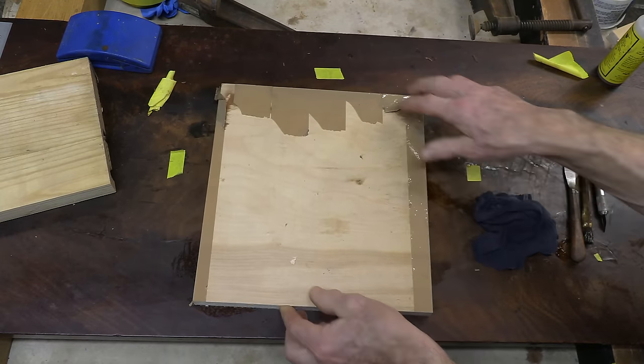I've been able to sand this really well with the block. I had used this block when I sanded the wood. I've just got to be really careful around my patch. I need to get this area leveled off. I've sanded as much as I dare. I actually was able to sand a lot better than I thought I would at this point. Got a ways to go to level this off, but I'm going to wipe down the top and do the glazing.